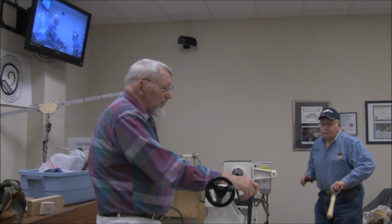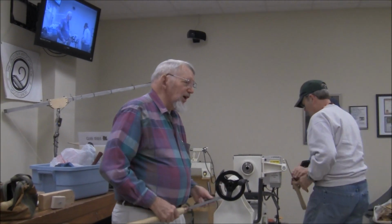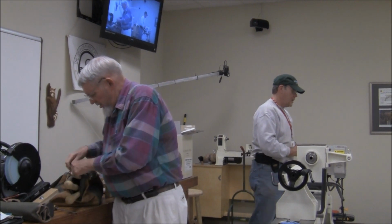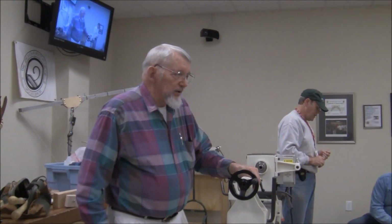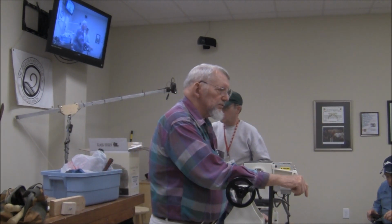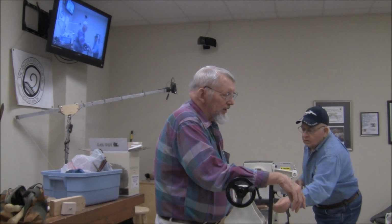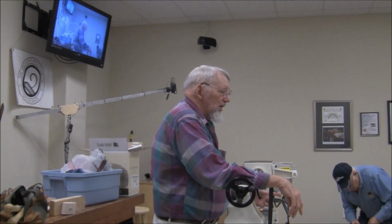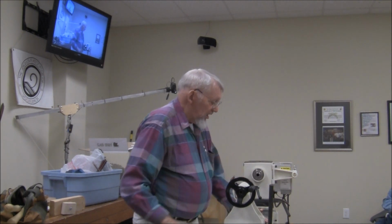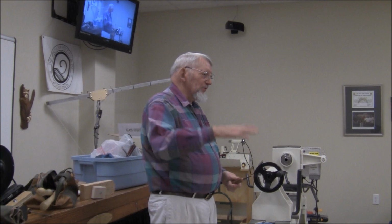That's useful, maybe, but keep in mind that just before World War II, high-speed steel was developed. And it was one of the things that helped win the war. It has the quality that it will hold strength, and it's for all metal machining tools. The use in woodworking is something in the last 20 years or so. The claim to fame for high-speed steel is you can put that tool bit in a metal lathe, really hog material, and that tool bit will hold its strength and its edge running at red heat, which is about 1300, 1350. And I'm not real convinced whether you've got just M2 high-speed steel or all the other upgrades.